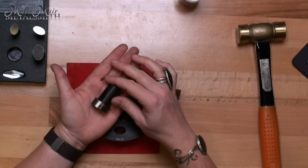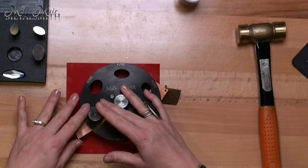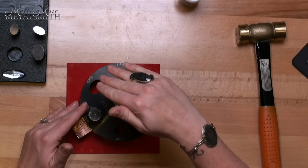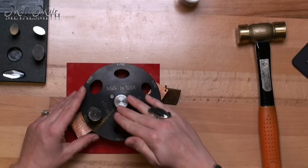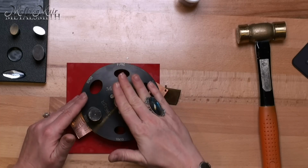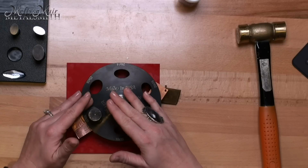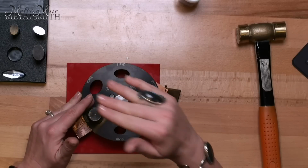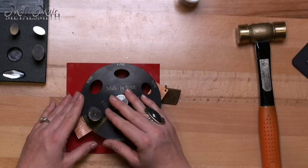And what this allows it to do is, when you put this into your cutter, it is going to begin cutting at the one edge and slowly work its way through, actually quite quickly, but it will work its way through the metal rather than coming down flat with all the force that way. So this is going to cut much easier than a cutter that is just ground flat. So you want to have that angle, and any good disc cutter worth its money is going to have that.